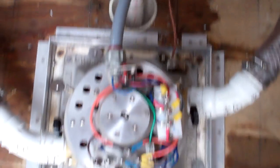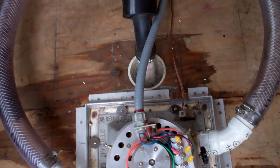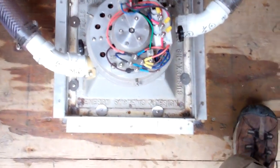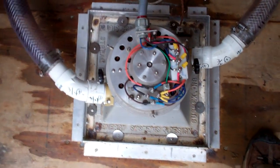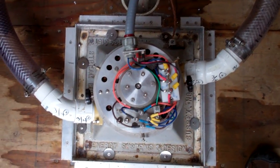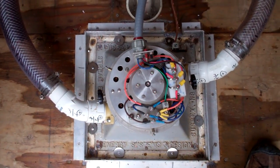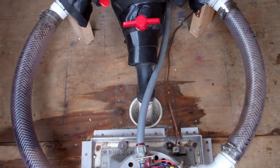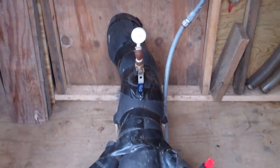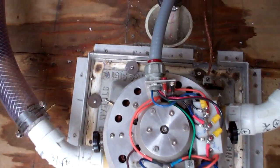There are the electrical connections — pretty straightforward. They run back to the house through that half-inch conduit. This is generating wild 3-phase, 240-volt AC — at high voltage because it reduces resistance, so you can use small wires like the 12-gauge back to the house. I'm on a battery-based system, not on the grid. So when it gets to the house it's transformed down into 12-volt, and then I have an inverter for 120-volt household items.